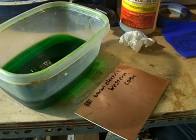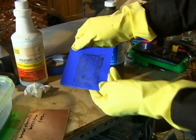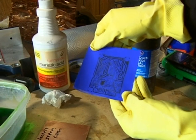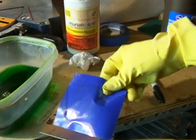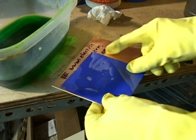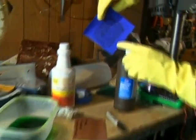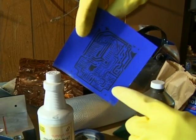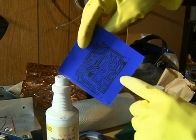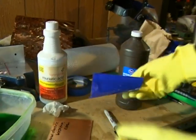In addition to Sharpie, we can also print things out on transfer sheets. This is a product called Press and Peel Blue, and you print it out on a laser jet printer. The laser toner will transfer off of this sheet if you heat it with an iron onto the copper — it transfers the image, in this case a circuit board image, onto the copper. Then I drop it into the bath, and anywhere where the toner has stuck via the iron transfer, we are going to have copper; anywhere where there is a space, we are going to have the fiberglass that lies underneath — all that copper is going to be eaten up. The ink we put on top to protect the copper and prevent it from being eaten is called the resist.